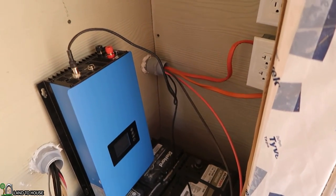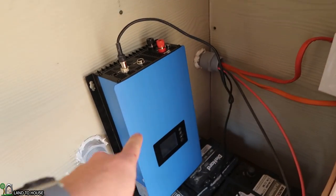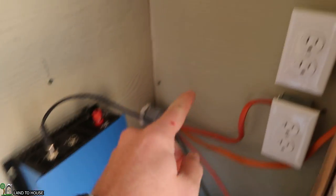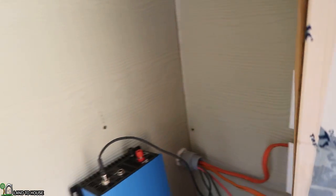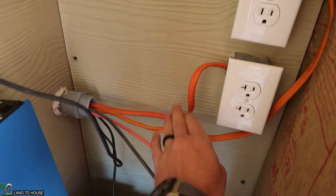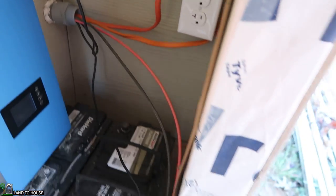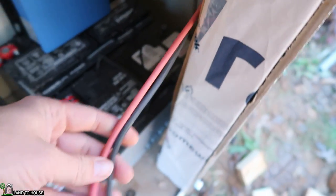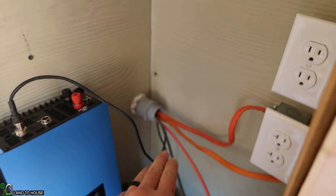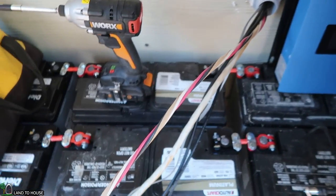Here's an issue I had: this limiter switch is only about 10 feet long, so I'm going to have to mount this inverter here and the other one right there on this side. I was anticipating having everything flat on the main surface, but we'll just do what we do. The two wires coming from the house main legs I mounted over here because that wire was also short, and the solar is short too, so I'm putting a box up here for that breaker. The hydro wire is over here — everything is off of course, except that — that's live.